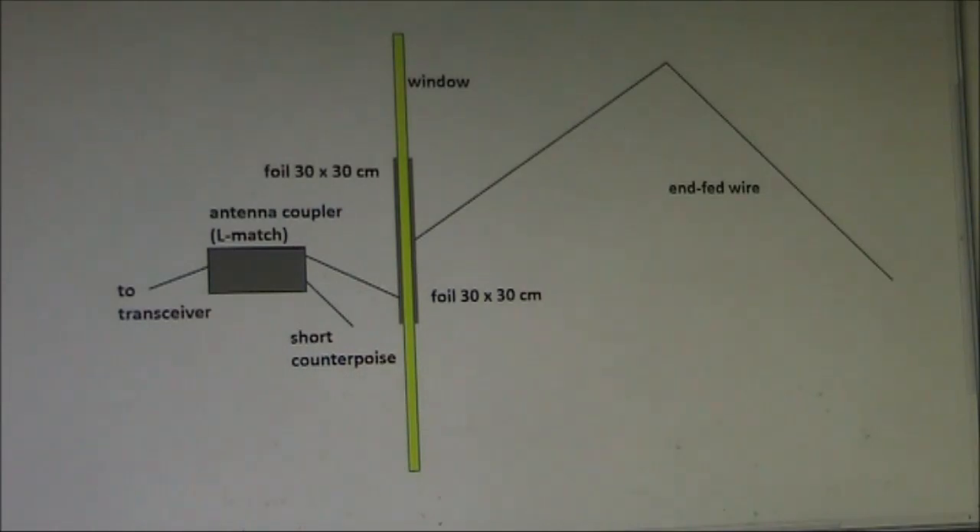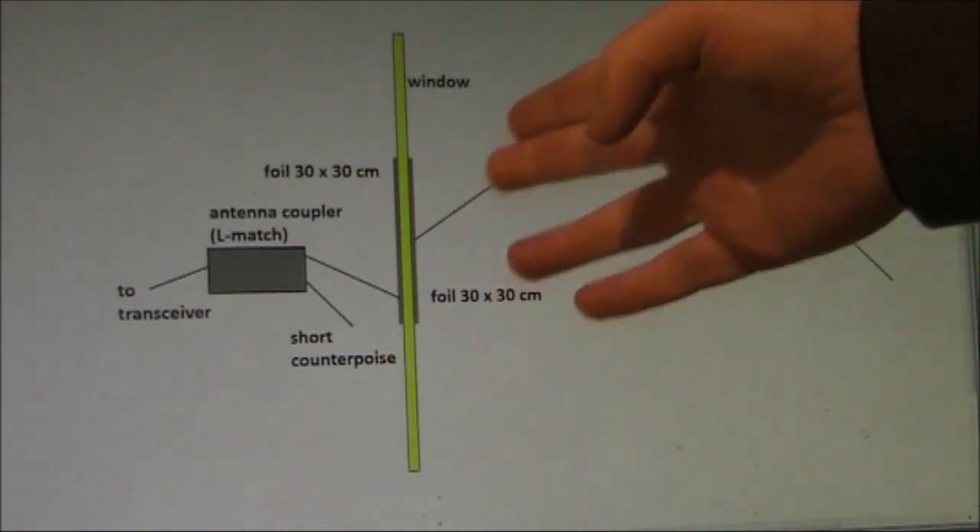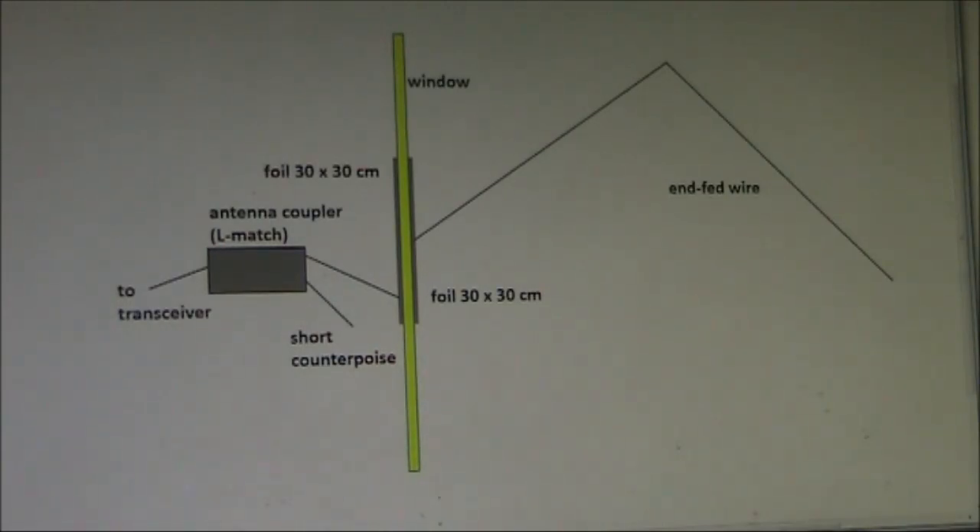So what's the summary? Basically, don't do it unless you have to. If you can, try to get your antenna wire going directly into the house. But if you've got no alternative, then coupling from the transceiver through a window to the antenna may be a way of getting on air. And if you're a shortwave listener, then the small amount of loss would be fairly inconsequential to the signal-to-noise ratio of your received signal. Although with an end-fed arrangement like this, you are likely to pick up more noise — including from electrical equipment at home — than if you had an antenna with a feed line and dipole elements splitting off at a remote location.